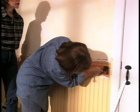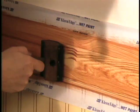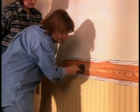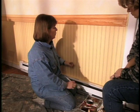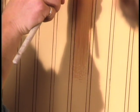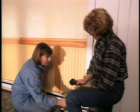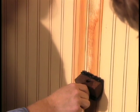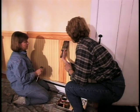I'm going to start right here and keep it along that bottom. You rotate it at uneven intervals so you don't have something that looks like it's been stamped on. Now I'm going to apply the faux bois graining to the verticals, treating each segment as if it's its own board, as it would be if it were real wood. I'm going to start with our lightest shade made from Raw Sienna, drag a little bit of the medium shade through there, then use the flogger and wiggle it down — it looks like a wavy grained pine.